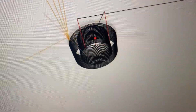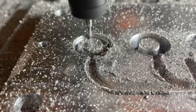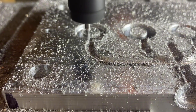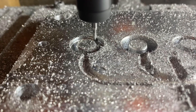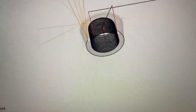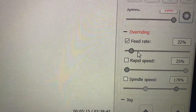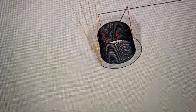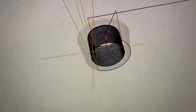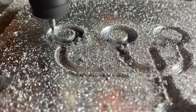This operation can go a little bit faster than the feed rate calls for, so I overspeed it — in this case 200%. You can see I'm in the last couple of turns of this ramp, which was running at 200%. I've now slowed it right down to 22%, as the bit has a little hard time at the very bottom of the pocket or ramp.